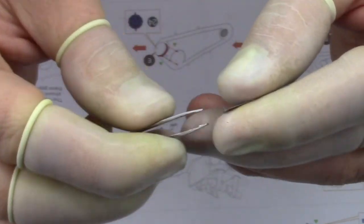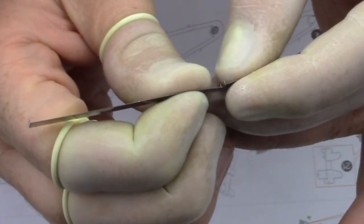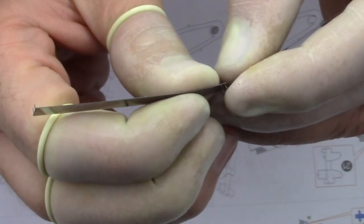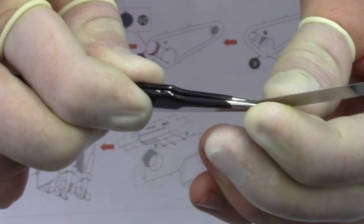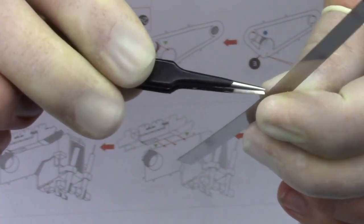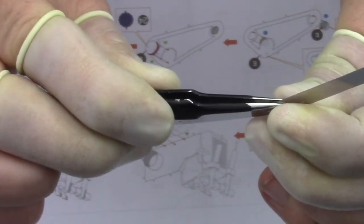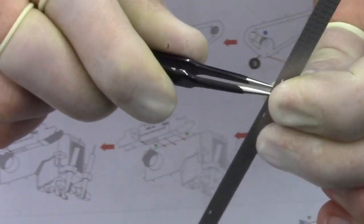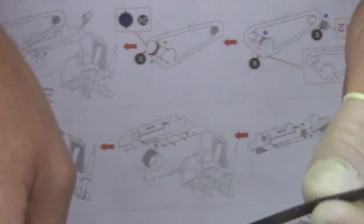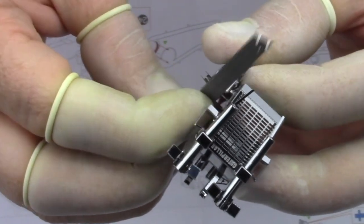I attached one end to part 25 together and bent the tabs at the other end at 90 degrees to prepare for attaching this part to the rest of the assembly. I did not, however, pay attention to the fact that the slots attaching the tracks are offset, and I should be placing it so that the tabs are offset away from the assembly. I put it on backwards. Perhaps that is why I ran into a fair amount of trouble attaching some of the tabs. I didn't figure this out until after I built the track for the other side.